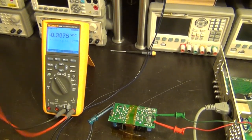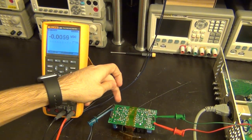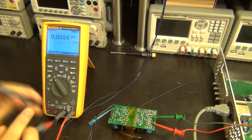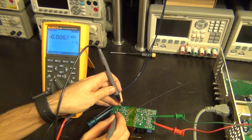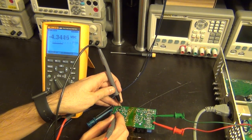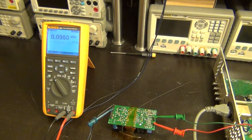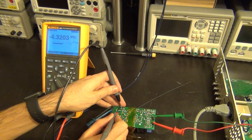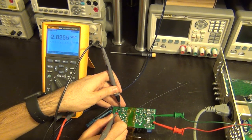But let's go ahead and take a look and see what happens when I try to probe the voltage of the reference IC. Remember, there's a reference IC right there. That's our 5-volt reference, and that's an adjustable one because it has a resistor divider on it. Now, if I go ahead and actually probe that, just by touching it, I can create instability. I know you cannot see all of this at the same time. Actually, let me turn the source meter off because its fan turns on really fast, because it's trying to dissipate the power from inside the unit. I just turned it off, so it's going to go down. Now, when I probe this sometimes, just by probing it, there you go, I just did it. I don't know if you can hear it or not. That fan is on now, but let me see if I can demonstrate this better. So you see how every time I touch the reference, it actually becomes unstable briefly.